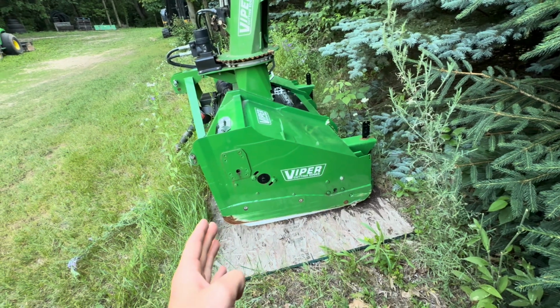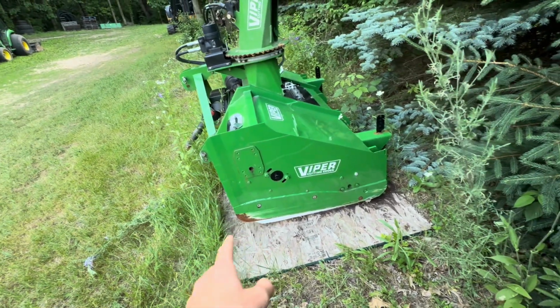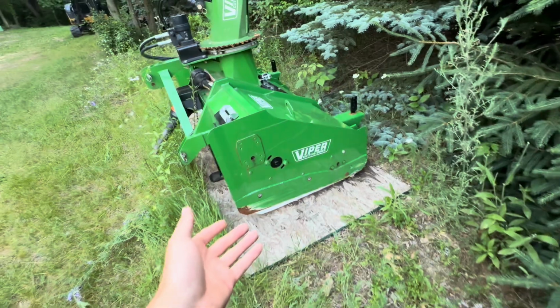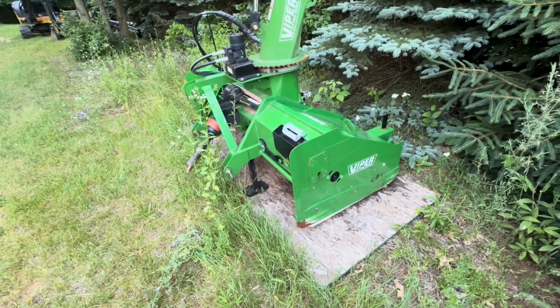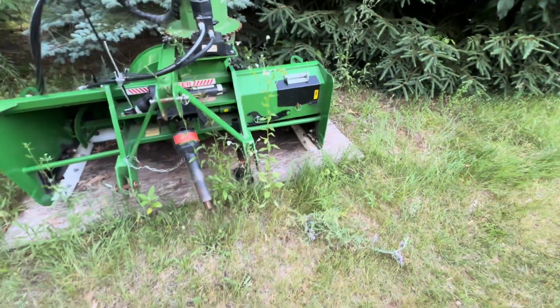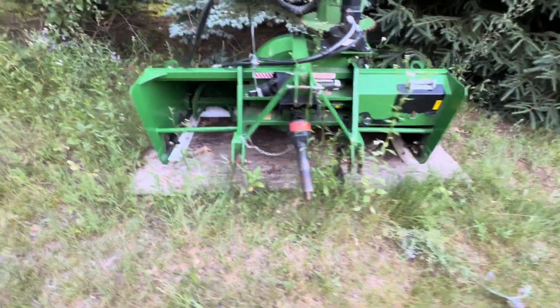Compared to the Normand, which is much longer. So the skid shoes are longer, and they need to be able to move up and down to keep the cutting edge on the ground when you come over changes in the driveway at the front of the snowblower. So I was thinking about that, and I don't believe that they move up and down on a Pronovost, although I did look at one today at the show, just not very closely.